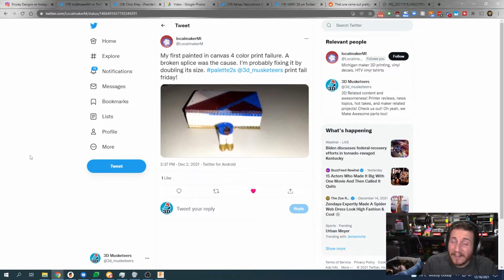That's actually the downside to a lot of single nozzle, multi-material, or multicolor 3D printing in the FDM space. The purge blocks are something that people don't talk about. So if anything, the fail is the purge block, because boy, that's a little tiny part. And I think that doubling the size of the part would not really increase that purge block any larger, and you might actually be able to do the wipe to infill to at least slowly try to remove some of that purge block. Even on the multi-material unit, MMU, from Prusa, it is a pain.